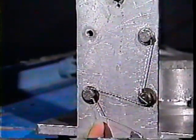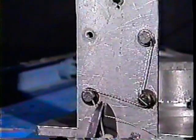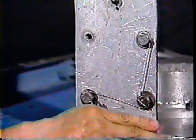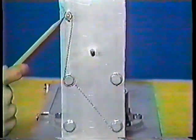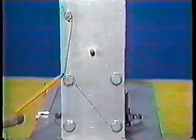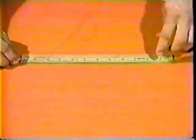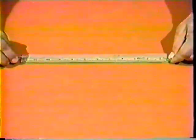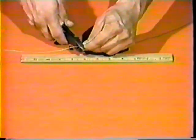Whenever the bolt heads are widely spaced, you may safety a maximum of three bolts together. Never lock wire fastenings or fittings which are spaced more than six inches apart. Instead, lock wire so that the span is less than six inches. Whenever there are a number of small screws or bolts closely spaced together, you may lock wire as many as you can with a 24-inch piece of safety wire. This is the limit.